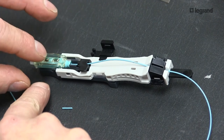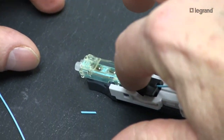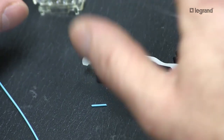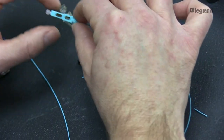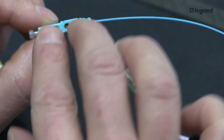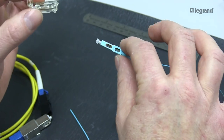At this point, I'm going to remove my cap — that's what's going to engage my spring to lock the fiber into place. Notice the placement of my finger: I'm holding my fiber in place. I pull the top open and gently squeeze until the cap comes off. That just locked the fiber in place. I can open the other two gates and I'm ready to do a visual. See these two windows right here? Those are your visual windows. When I put my light source on, if there's no light coming out of these windows, you're doing fine. If there is light coming out of the windows, we're going to remake this connector. Again — reusable.